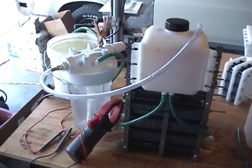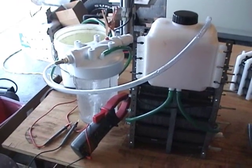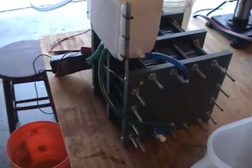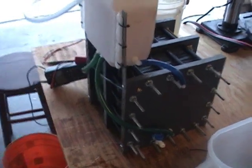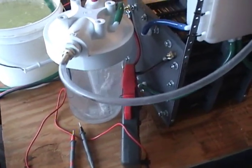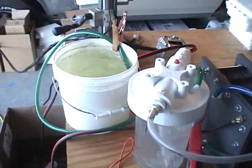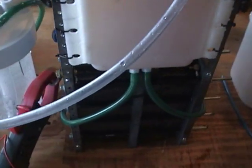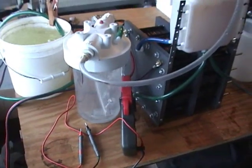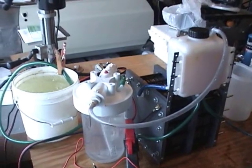In the next video I'll do a production test, see how much we can get out of this. I'll let the cell condition a little bit more, see how high we can get it. I think the voltage between the plates is a little low — I want to get it over 2.5 volts. So I might take a plate out of each side, because I do want to get this over 20 liters a minute, and I think it is possible with this setup.